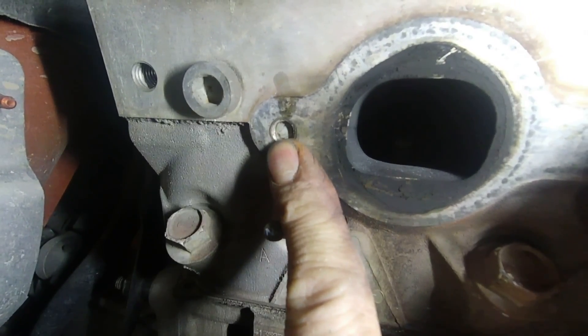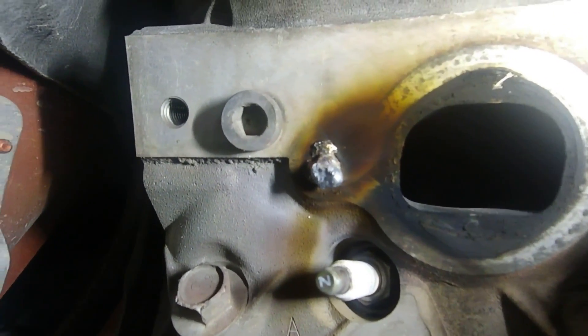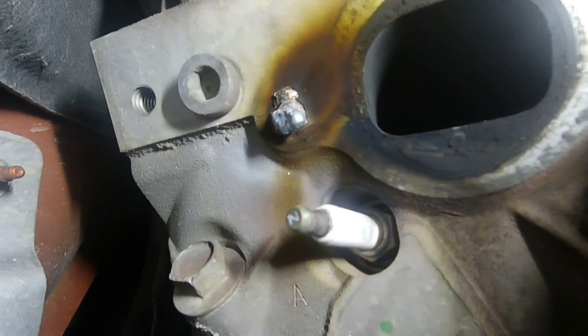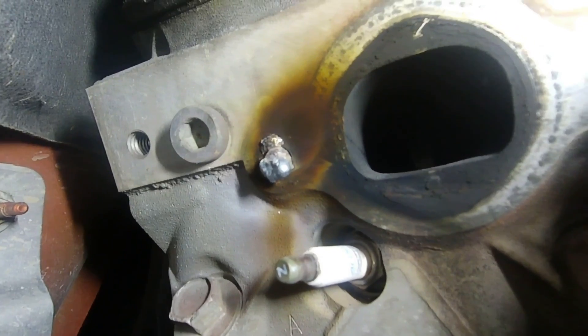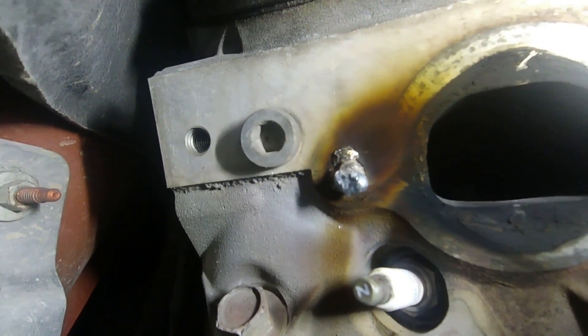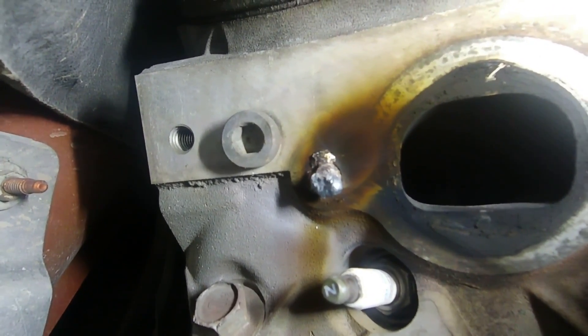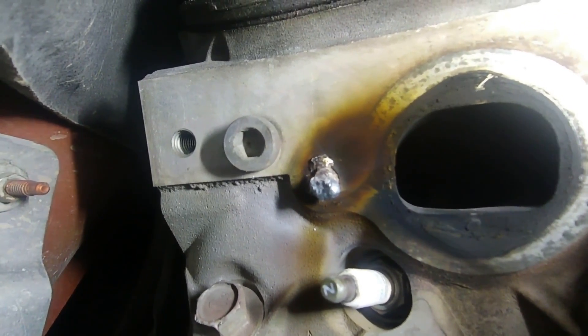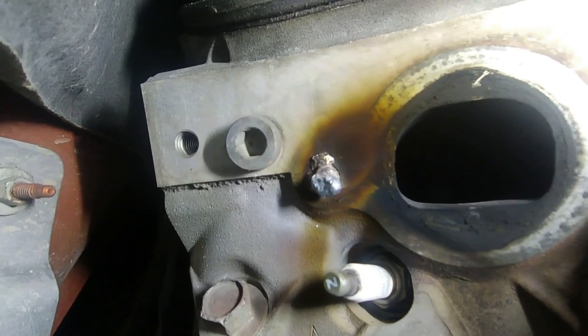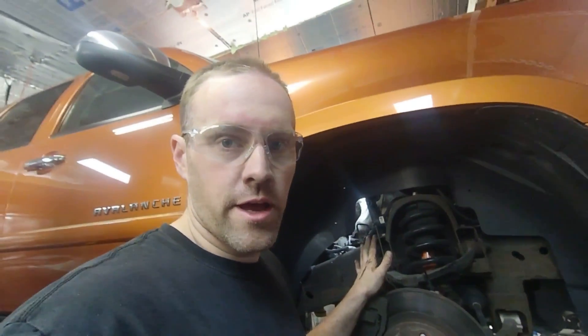If I had a wire feed welder I could put the nut against there and build up the weld into the nut, but all I have is a TIG welder. You can see the nub I've welded on there — it's rather ugly but it should do the job. I applied as much heat as I possibly could. With a TIG welder, the soot fouled up my tip a little bit, so I'll have to regrind it. I'm going to grab a large nut — about 15mm socket size — and weld that on top.